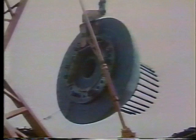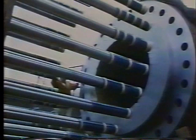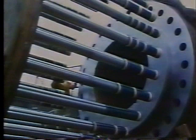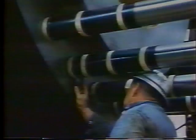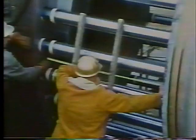For the first time the two would be joined together. The 28 studs which hold the sphere to the shaft were first threaded into the sphere, coated with asphalt paint, and covered with fiberglass and resin to protect the machined surface. The sphere then engaged the ten-foot diameter spigot of the shaft — a risky business. It is a tribute to the construction contractor that the sphere was so rigged for the lift that it hung plumb, and was drifted without interference onto the shaft without any damage to the stud threads, which were protected by lengths of stove pipe.